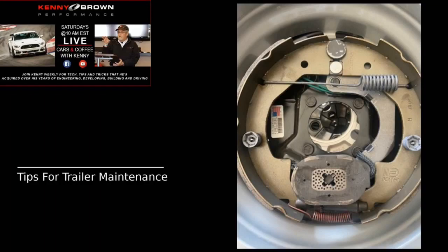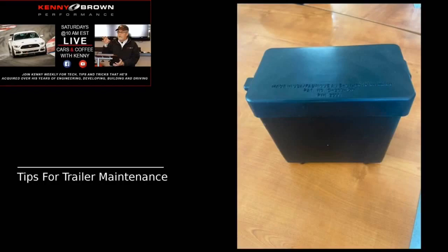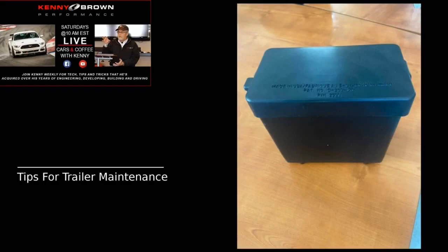When checking aluminum wheels — especially on trailers with spread axles or tri-axle trailers — be aware that none of those trailer wheels turn when cornering or maneuvering in a paddock, putting tremendous stress on the rims. Check rims for cracks, as they will crack over time. This is more prevalent on tri-axles with heavy cornering during paddock maneuvering. Also watch for the rear seal and repack wheel bearings as needed.